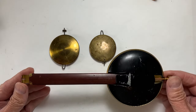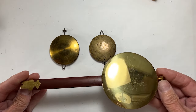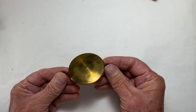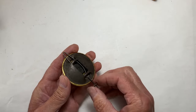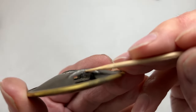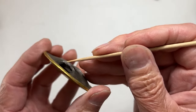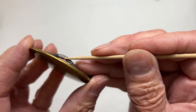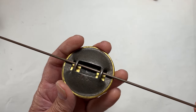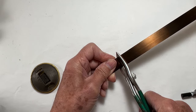The clock is missing the original pendulum and pendulum rod. The owner sent three possible ones to use. I'm going to choose this one because it has small half-round recessed areas built right into the original casting. The recessed areas are for a pendulum rod to fit into like this — it just needs a tension spring to work with a single rod.